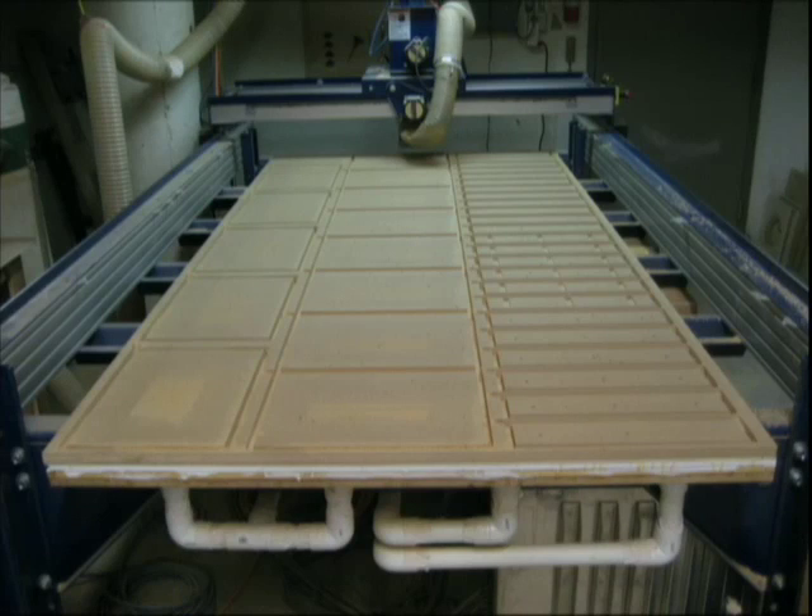This is my tool — like the one outside but bigger and a lot dirtier. This photo was taken when I first got it; those are cabinet parts. The beauty is being able to stand and drink coffee while it does the work. The white pipes are a vacuum hold-down table — key to effective CNC use. You throw down a sheet of plywood, turn on the vacuum, and you've got 14 pounds per square inch holding the material. The cutting is the easy part; material hold-down is the real art and science.